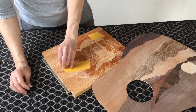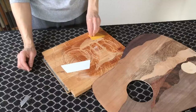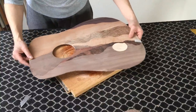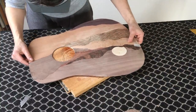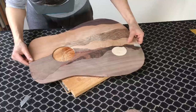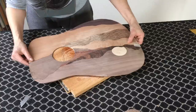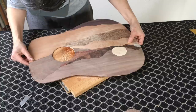Well, clever as I am, I realized I could have left the veneer in and the new center of the sound hole in order to make the new rosette for the guitar. But I didn't think of that, so I have to relocate the center again, which I've done before. And now I'm gluing the top with double-sided tape to my circle cutting board, and then I will use the Dremel again to route the channel for the new rosette.